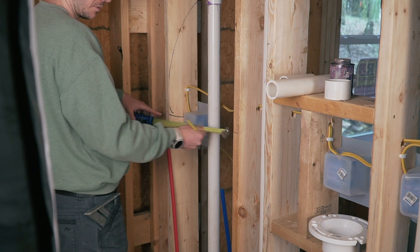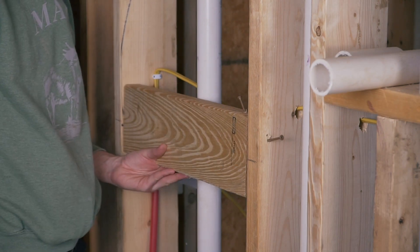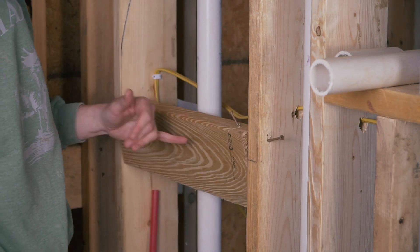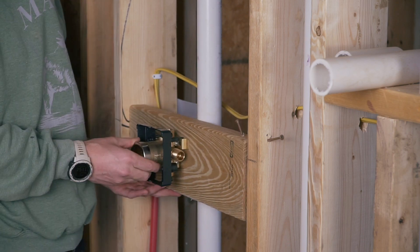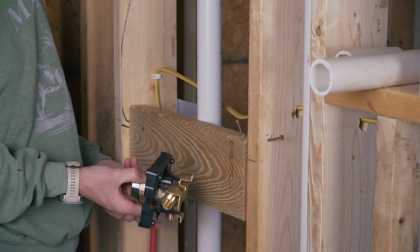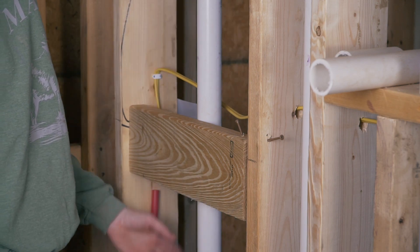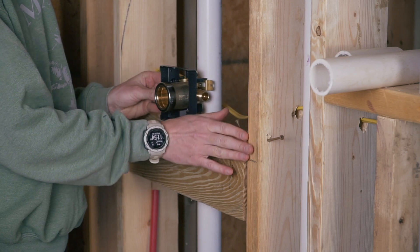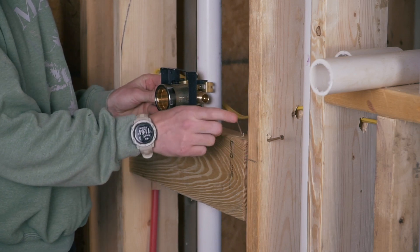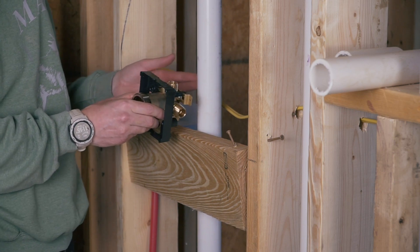So it's 17 and a half — wait a minute, that's not going to work. It's not going to work because we need this to be much deeper. That's when I realized something was definitely wrong. My valve here needs to be flush with the finish wall — the backer board and the tile. So it needs to be recessed, but the vent is in the way. And obviously I didn't think about that.